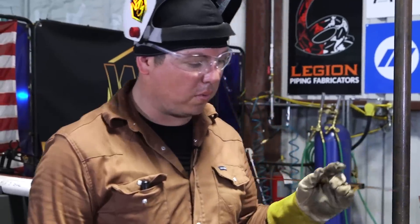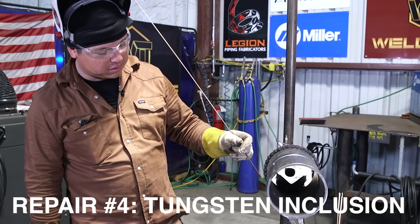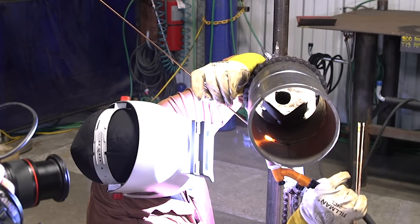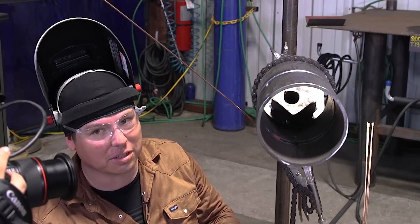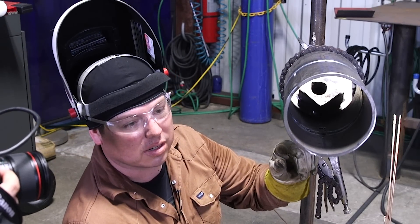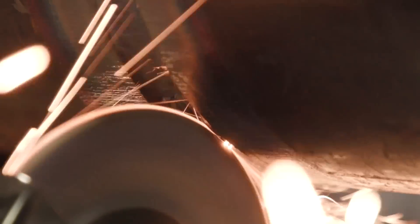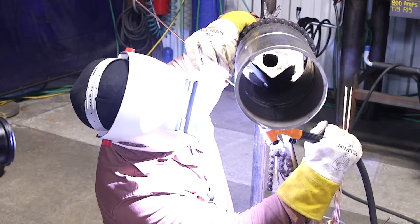On our last fill, I'm going to put a large tungsten inclusion right in this area - we're going to have to dig that out. I'm going to get my tungsten stuck in the puddle. Had to break that off, now we got the wire stuck and a piece of tungsten inside. I'm going to grind this out. Make sure you get that tungsten out of there - tungsten is more dense and it'll show up extremely bright on X-ray. It's denser than most metals so it's going to be very noticeable on X-ray. We'll go ahead and finish filling it all the way up.